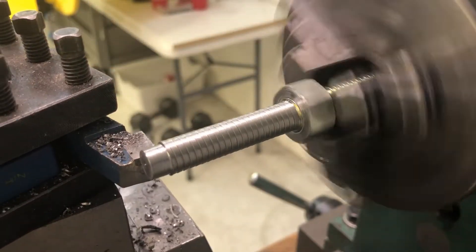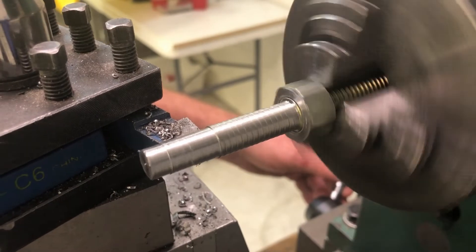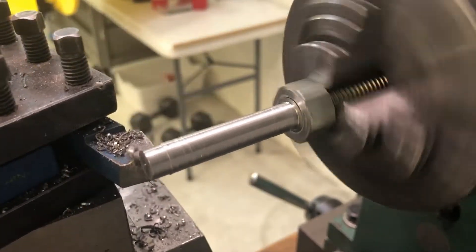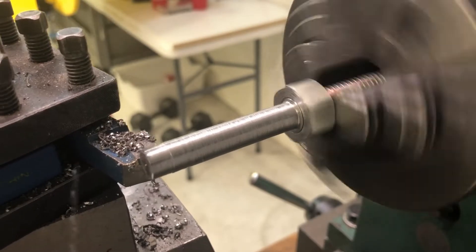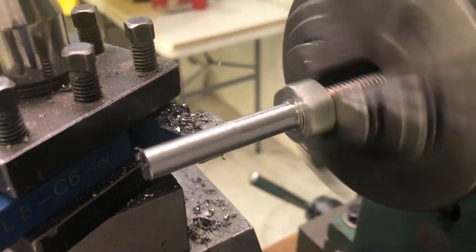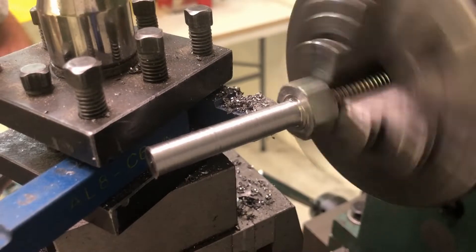I'm doing a little test here on the end, removing material until the bearing will slide on, to give me an idea how deep I really need to go. I could use my calipers, but I've done this so much — this way is just faster. Get the material basically removed so you can slide the bearing on, then take a scotch red pad and buff a little bit. If you're doing plastic wheels you'd want this chrome polished, but since I'm putting bearings on it, it's not that important.